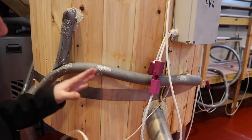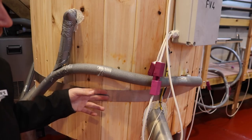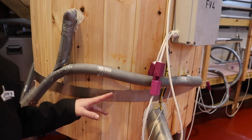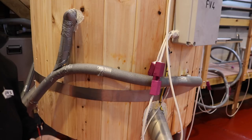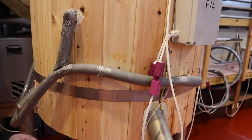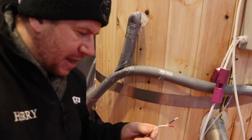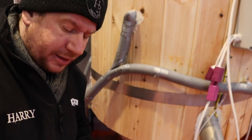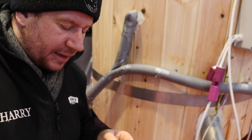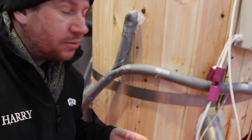In the future I unfortunately have to strip off all the timber and banding and replace them with underfloor heating cable, which we did to fermenter number three over there, because that heats up a lot better. I'm going to go ahead and wire this cable in, and then I'll take you into the pub and show you what we got up to yesterday - I forgot the camera - and you'll see we put some awards on the wall and finally got some pictures up.